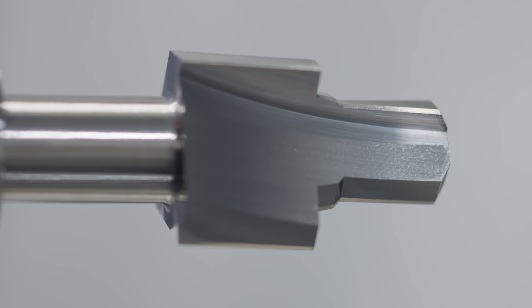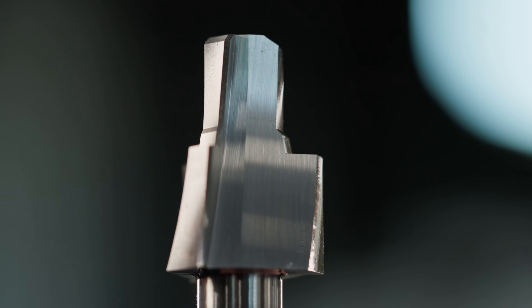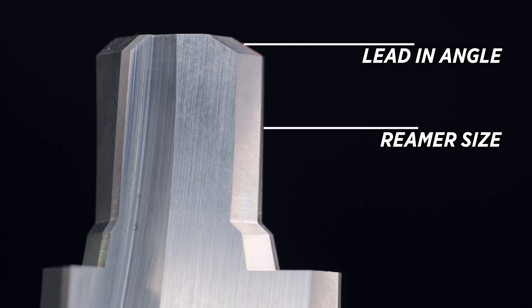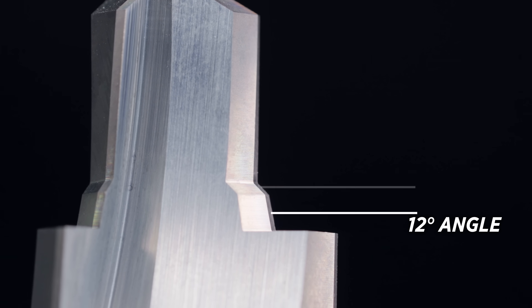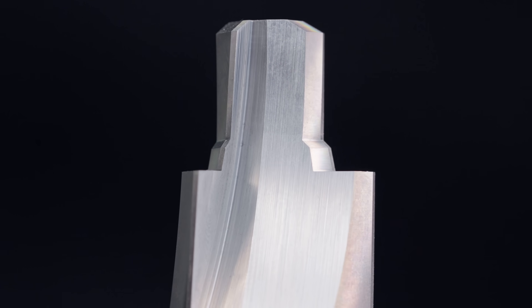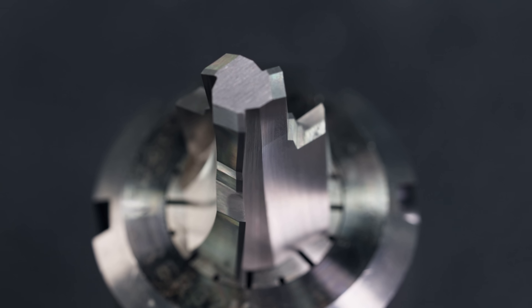The tool is finished and it looks great. Let's break down the geometry: the first angle is a lead-in that leads up to the reamer size so I can thread the port hole. Then there's a 45-degree edge break, followed by a 12-degree angle, and after that is the spotting face. Those are all the components that make up this SAE port number six porting tool.